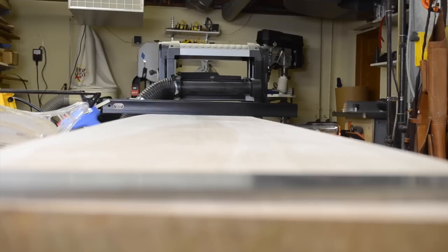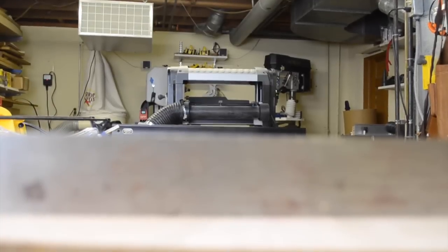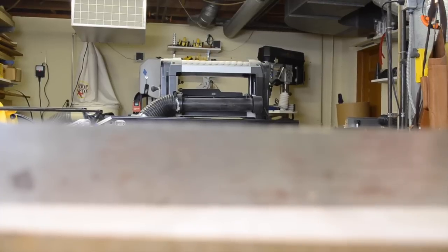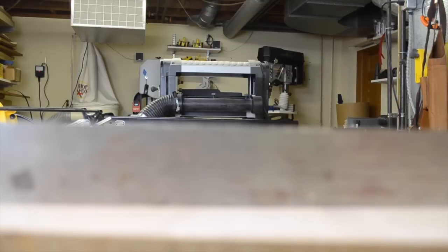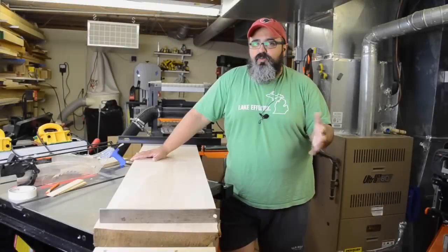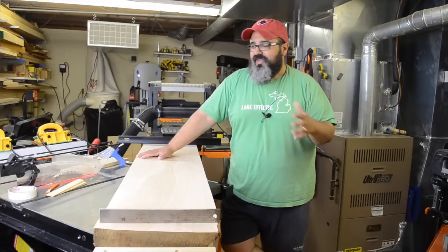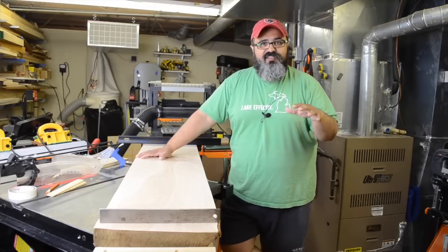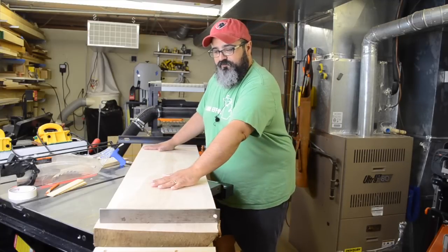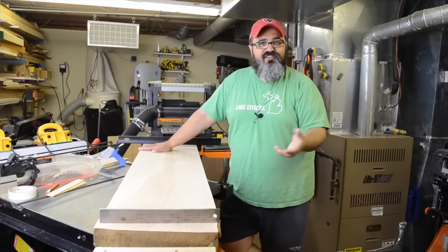To further prove this face is flat, I have the sled on a nice flat surface and I'm using two straight edges acting like winding sticks. The camera angle isn't doing it full justice, but you can see along the front edge compared to the edge at the back — they look pretty dang parallel. Winding sticks are a great tool for checking surfaces for any wind or twist. The thickness planer sled did its job and got this first face nice and flat, and we're set to flip it over and get those two nice parallel faces.